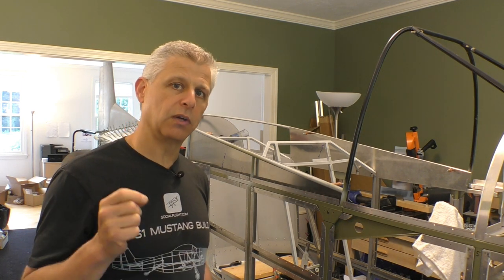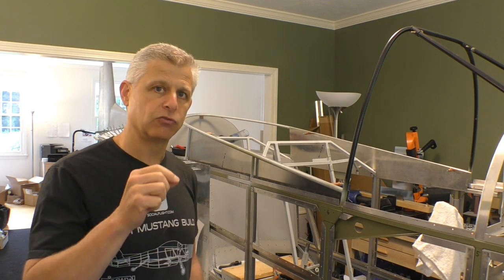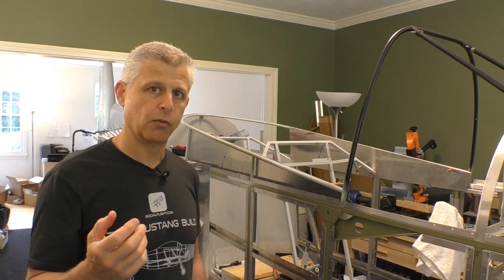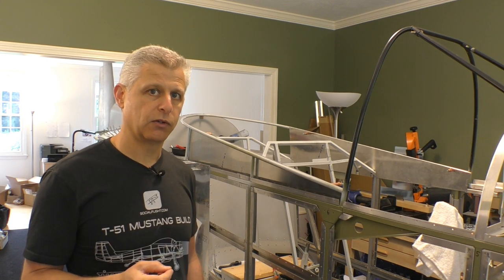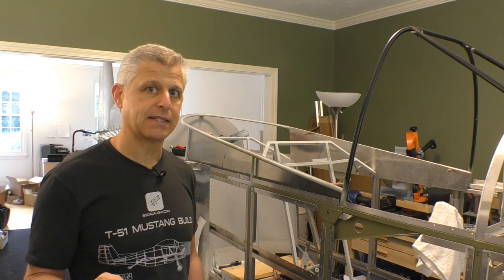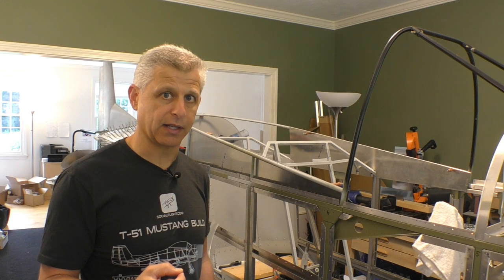But if you drill into aluminum first and you have something harder behind it, you can find that the drill will wander and really chew up the aluminum, make a bigger hole in the aluminum as it works its way through the steel. We found the same process when we were doing the skin on the belly, where it was very thin fiberglass and aluminum behind it. We pre-drilled the aluminum and then can just punch through the fiberglass.